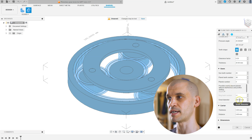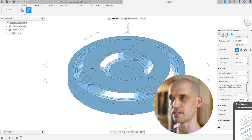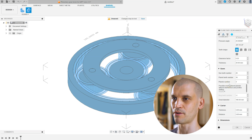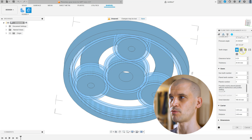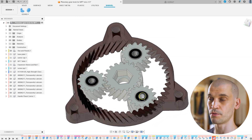I knew I wanted my ring gear diameter to be about 55 millimeters, and then I played around with the sun gear number to try and get as high a ratio as possible. I've got about 109 teeth on my ring gear, my sun gear is around 40, and the planets are around 20. If you do the calculations it works out to about 3.5:1 gear ratio. The add-on is really cool — you can see exactly what you're building and there are many options for the teeth shape. I originally tried herringbone but couldn't figure out assembly, so I went with helical. I've then just modeled in recess holes for the bearings, added a hex shape for the M6 hex head, and added wings to attach to the plate using wood screws.